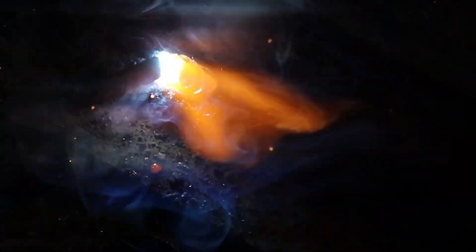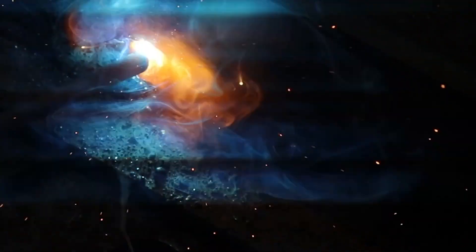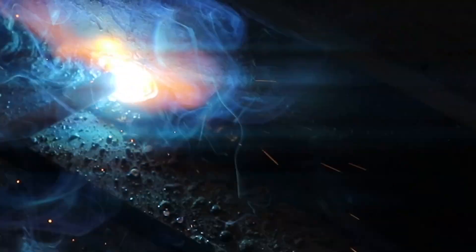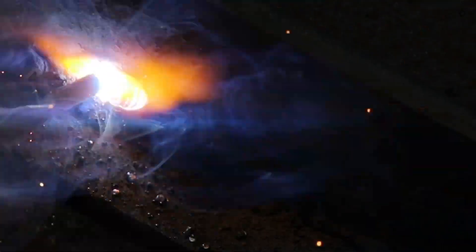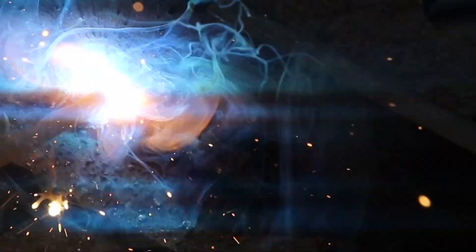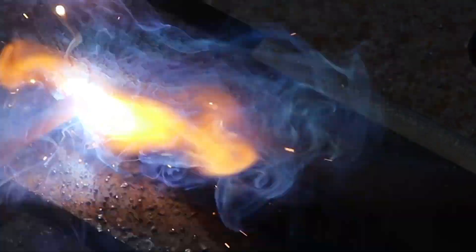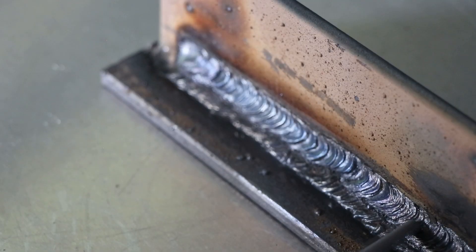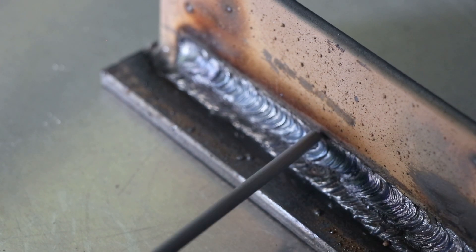I'm going to turn it down a little bit. Got my new electrode. I just didn't like the way I was gouging into the top plate there. I originally started at about 120 amps and, hindsight, I should have turned that down a little bit. I ended up running this last pass at about 80 amps. I used two techniques — for the first pass I was going back and forth, and then on the second pass I was doing a circle, keeping that arc nice and tight. I didn't really like the way the bottom came out, but it was good metal — just aesthetics. And I started on the third stringer right here and I didn't like how much it was digging into that base material, so that was about 120 amps. I turned it down to about 80.